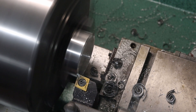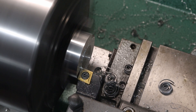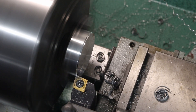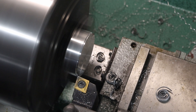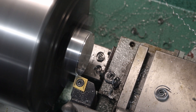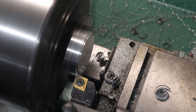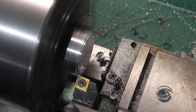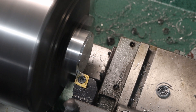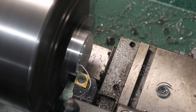I flipped it around, set it to be parallel, and then faced off the end — actually stopping and backing off slightly to break the chips. I want the shoulder that holds the watch case in place to be 1mm thick. So I'm using the feature of the ELS-4 Basic that will turn to an exact depth of 1mm. Now I need to set up the X axis so that I can do this completely automated, so that it will handle both the Z and the X and cut it down to diameter, which I will be doing in a future video.